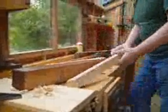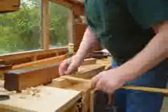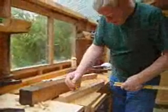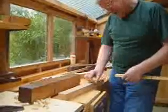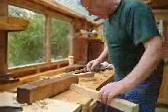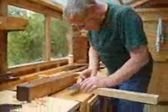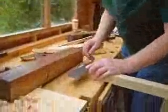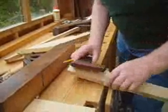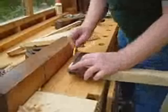Now, that's face and edge. I've lost that marking. I want to make it parallel now and flat, but I know that I'm going to be removing a slight amount, a tapering amount, off the inside of the leg. These are going to remain flat and straight. I'm going to cut off the end of the cobweb here, yes. I'm going to take the end off of here, and I'm going to use a fine saw so that I get a nice clean edge to work with.